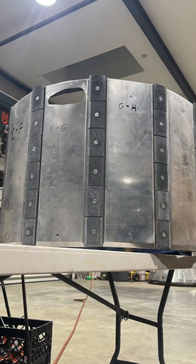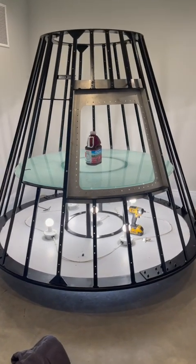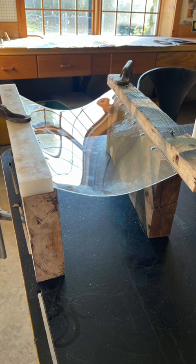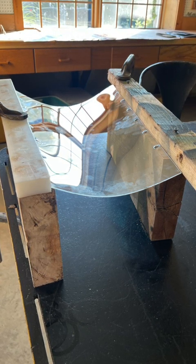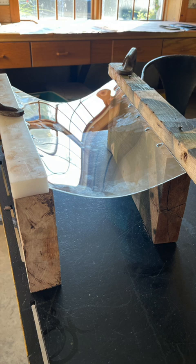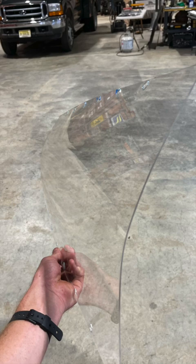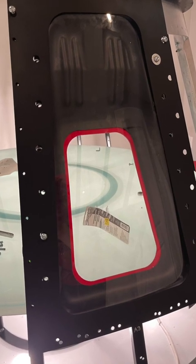Back to the recovery section, back inside my garage — the frame is kind of sitting there all set up. Back to the window: the outside piece of acrylic for the window shroud — I was trying to bend it around the frame and bolt it into place, but it was such a large window that when you touched the outside of the glass it would just want to bounce back to flat. So I set it up on a table, clamped stuff together, forced it into a curve, then blasted it with heat so it would stay at that curvature and bend into the proper position once I bolted it in.